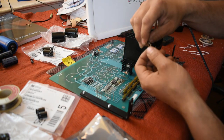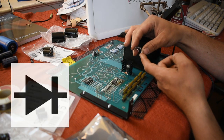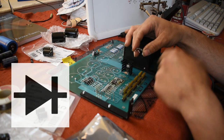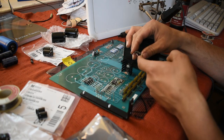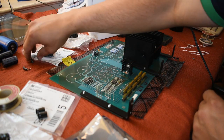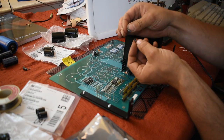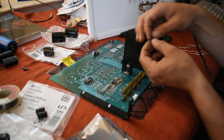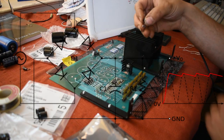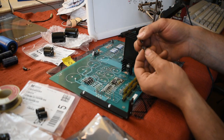First of all, this is a diode that's not ruptured. This is the one that was right beside it. Basically, a diode is an electronic component that allows electricity to only flow through it in one direction rather than in both directions. You have the anode side, where the power comes in, and the cathode side, where it goes out, right? Well, this is what happened to D3, diode number 3. I believe the arrangement here, even though they're all in a line, is set up as a full bridge rectifier. And when this overcurrent situation happened, well, I guess I popped it.